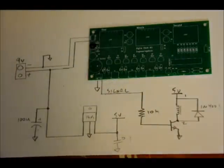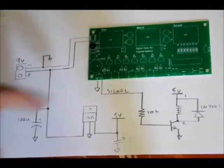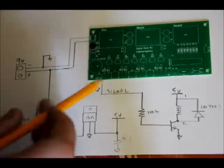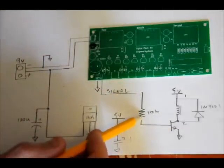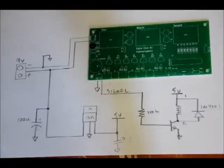The output signal comes from J3. On the board it's labeled GND, which is ground connected to our common ground, and OUT — the signal that will turn on our relay. There's a protective 10K resistor in series with the signal line and the base of the transistor. That's an NPN transistor — you can use a 2N2222 or a 2N4401, a low-power NPN transistor.